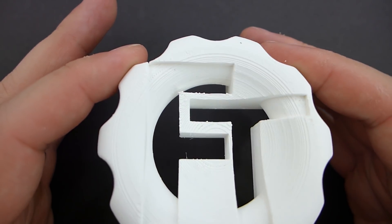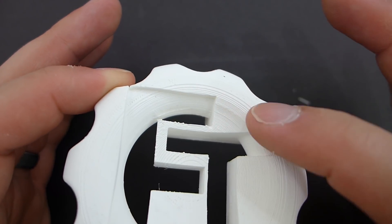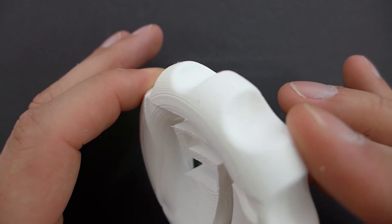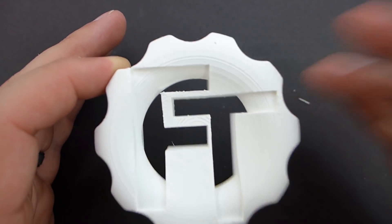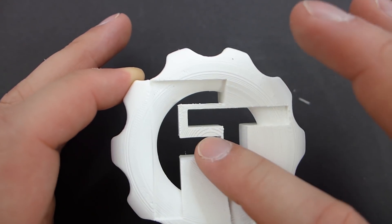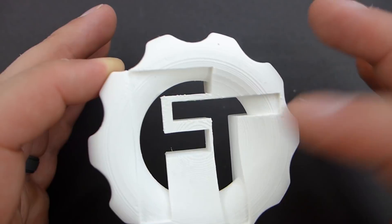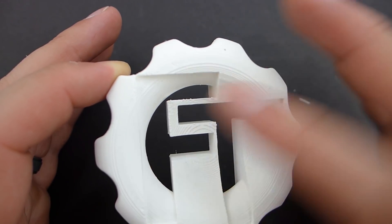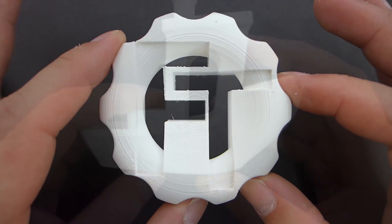There's a little bit in this one too — we need to use an X-Acto knife just to get off the fine details of dense infill, because you should do a dense infill on top of your support to ensure a nice flat surface for the actual print. Bottom line, it was great — a little bit of lifting, but not too much, nothing that came off the print bed. On top it looks good. I might have overextruded a little bit, as you can see with the details — there's some ringing in the circular pattern. Either way, it was a good first test of the filament.